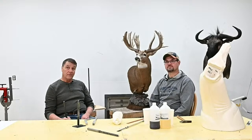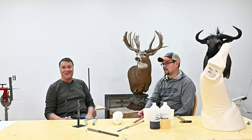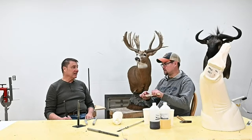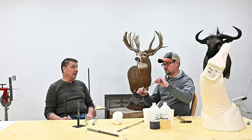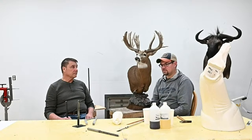Sandy would like to know, does a square stock and tube list a weight limit? Oh, I'm not sure if he was talking about this one. You're going to have to say, I think this will work. Yeah, and that's going to depend a lot on how far the cantilever is, too. If they were tight, I bet this would hold quite a bit of weight straight up and down. But out over an angle, it may be a little bit weaker. So, I've never seen anybody say good for 78 pounds or anything like that.